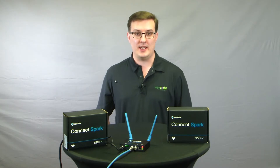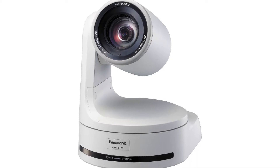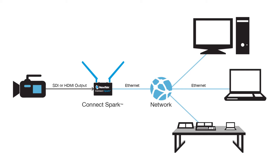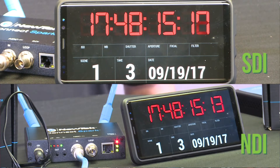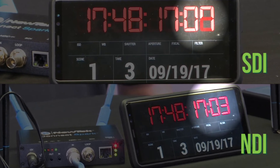For today's test, we're going to compare the NewTek Connect Spark's quality and latency against a controlled camera — the Panasonic AW-HE120. The project in the TriCaster TC1 has been set up to 1080i 59.94, and we've matched the Panasonic PTZ camera to that format. To feed the Connect Spark, we're using a Sony PMW200 set to the same settings. What you're seeing at the top of the screen is the Panasonic PTZ coming in over SDI directly to the TriCaster, and below it, you're seeing the Sony camera coming over the NewTek Connect Spark wirelessly.